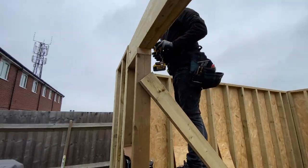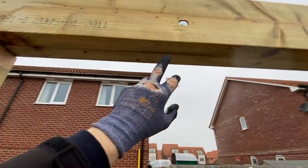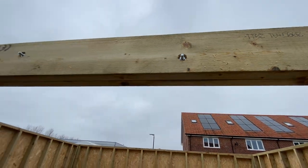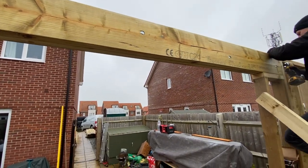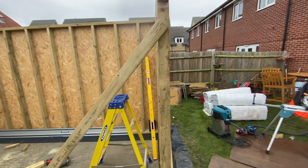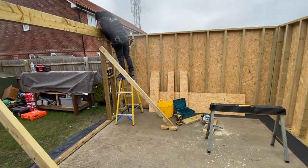James is fixing up our lintel now. We're just going to tag it all into these points here from the bottom and sides — get as many fixings into it as we can. We fix them all together with 100mm bolts, sink them in a little bit, put a washer on them. That pulls this side into the joist nicely and fixes them together well. We've put our diagonals here for a bit of support. We put a level on these and they were a bit out, so we've pulled them in plumb and fixed both sides. We'll leave those there until we put the roof joists on, because that will hold the whole front together. Once the roof joists and deck are complete, we're a solid box.